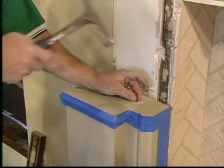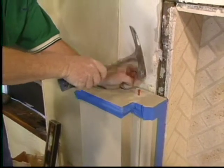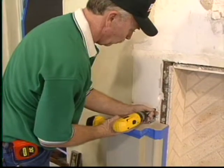You should use 1/4-inch plastic shields and number 10 screws with the angle brackets, otherwise the grout joint will be too thick. If you're using brick ties, you can use the same thing, the shields, or you can also use a screw called a Tapcon screw. Now Tapcons won't work with the metal brackets because they make a 5/8-inch grout joint. It's too thick. When you use them with the brick ties, it makes a 1/4-inch grout joint.